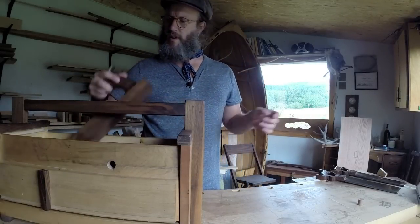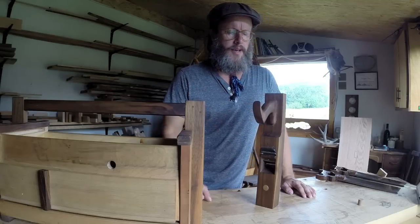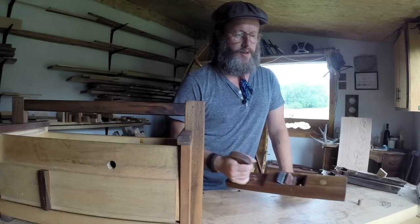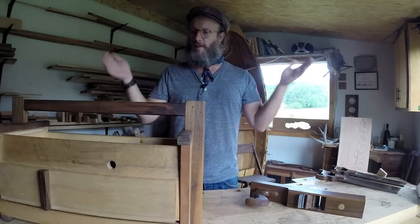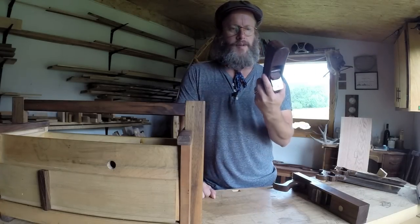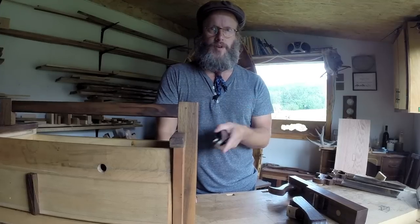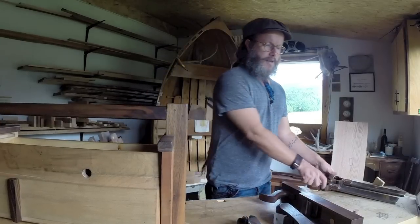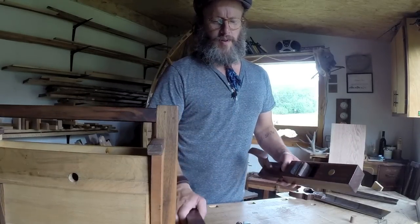When I cross-cut the plank of red oak, I take out the jack plane. That's basically what's going to take it from rough to almost smooth — I can get it pretty smooth and pretty flat with this. If you're working with big-scale stuff, pack in the longest plane that will fit inside the kit. Smoothing plane — same game — this brings it down to a glass finish. And a block plane for all the in-between stuff: end-grain chamfers, adjustments, fine tuning. Those three planes, two backsaws, two panel saws — that's the kit. You could cut out the smoother and just have a jack and a block.